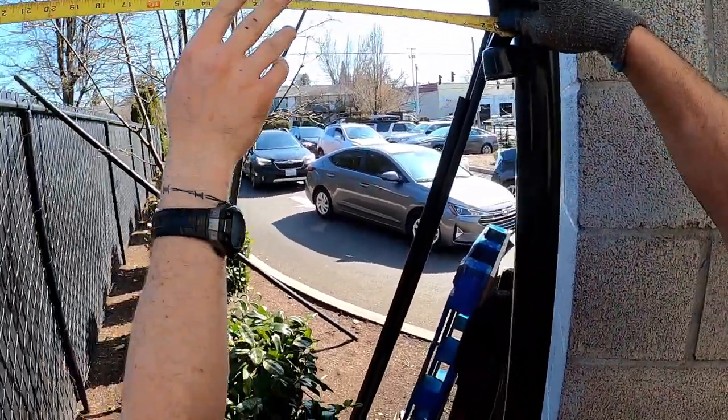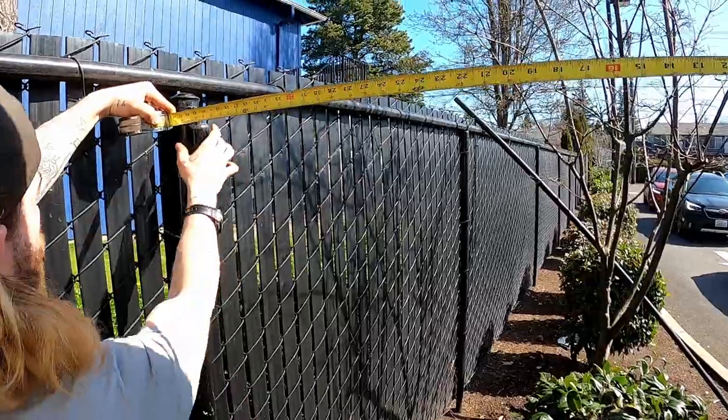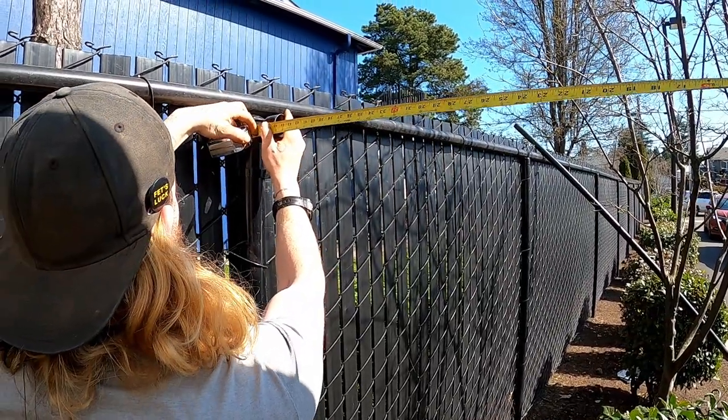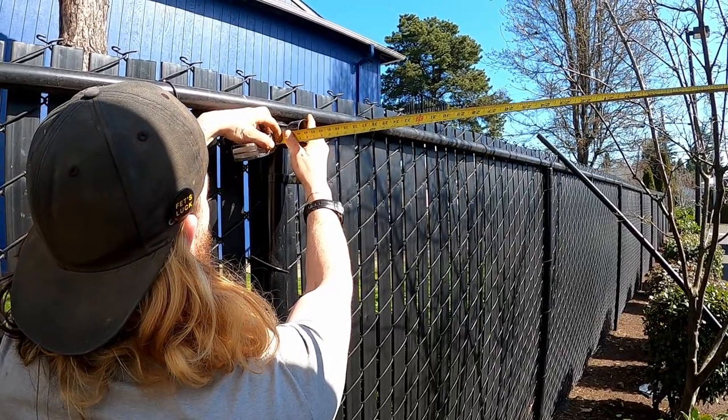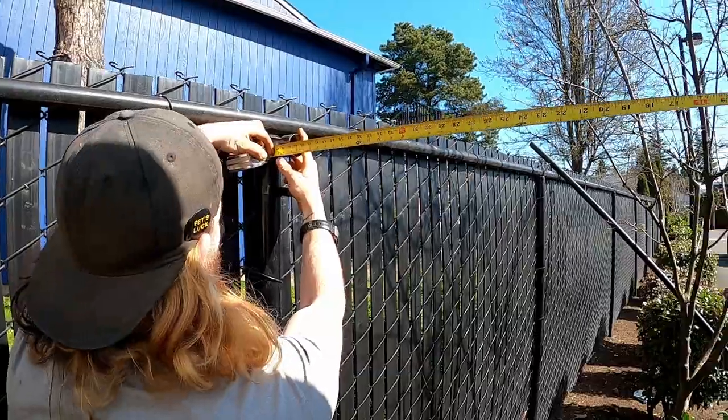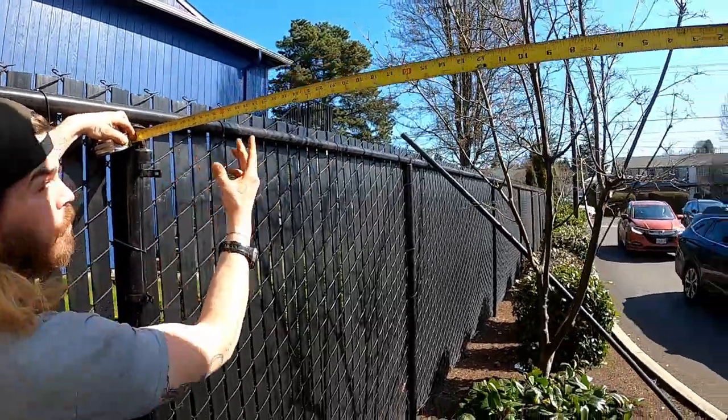So on the end of the bolt and go over and pick up the rail end. Measure to the back of the rail end. What is it — 47 inches? Okay, deduct one inch. Deduct one inch, that would be 46 inches. So we're going to make a cut at 46 inches.